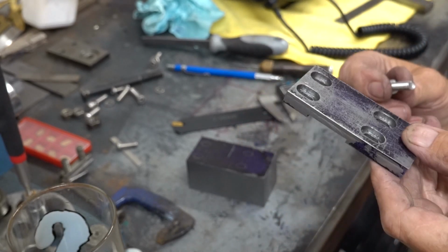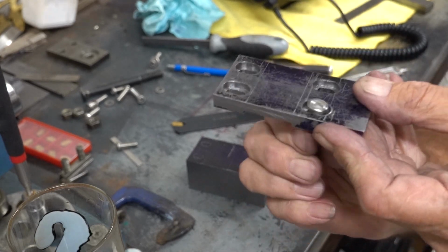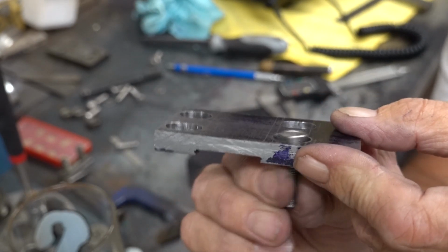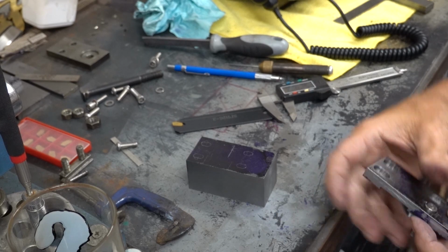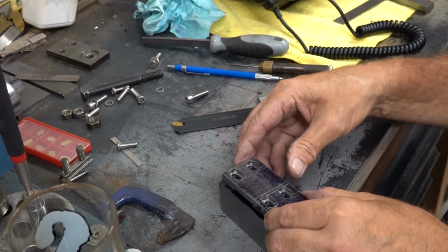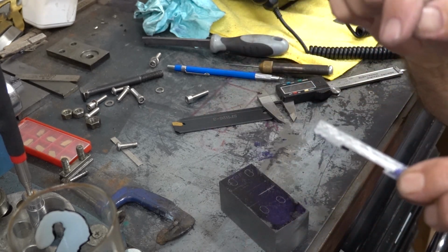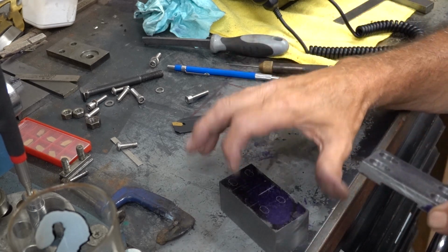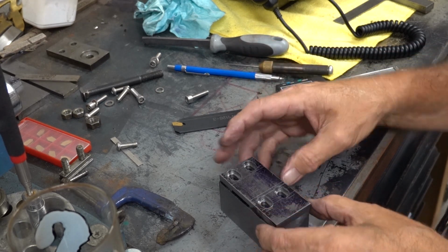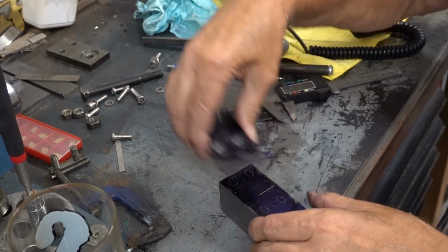So basically I've drilled them and I've counterbored them. So now we've got the adjustment I talked about. I've transferred through. Originally we were going to clamp this and drill straight through with pilots, but I realised the pilot holes I had were at the beginning and at the end of the slot. I needed them in the centre, so I couldn't do it that way. So I've clamped this on with this little G clamp, and I've marked them through.